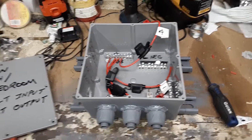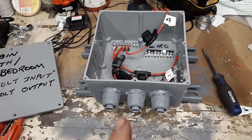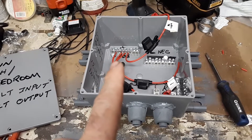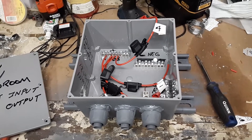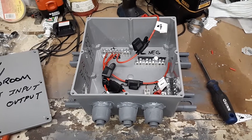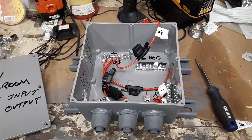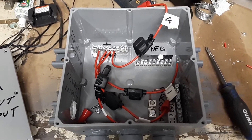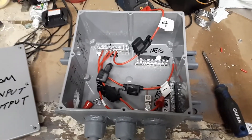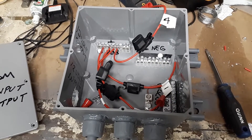Another reason I'm doing this: with these connectors, I can put the wire right in and connect up without buying MC4 solar connectors for cable. I don't need the crimp tool, I don't need the connectors, and I don't have to worry about something going wrong. All you have to do is get some wire strippers, strip it out, and land it down on those bars.